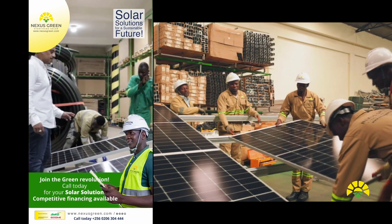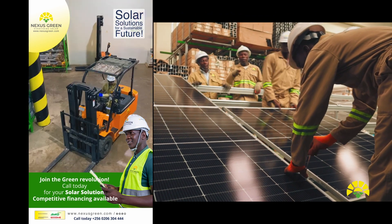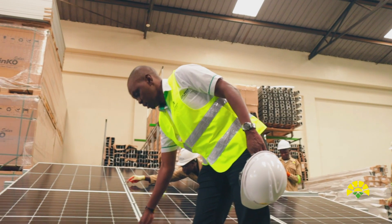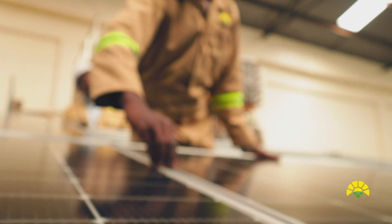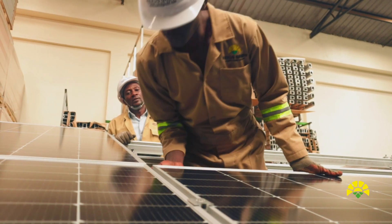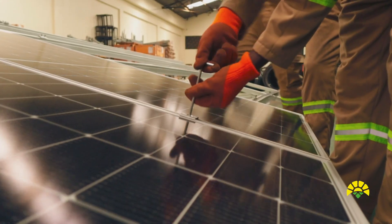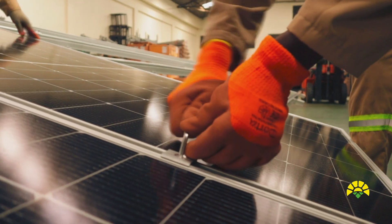This particular panel is the 550 watt peak panel, but we also have 475 watt. Regarding color — some panels are black, some are blue. The darker shade indicates better technology: monocrystalline panels have a slightly darker shade and ensure more efficiency. These are what they call half-cut panels — the efficiency of absorption of sun rays is much better, giving you better efficiency overall.